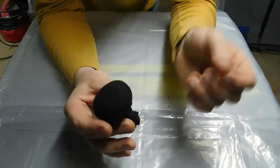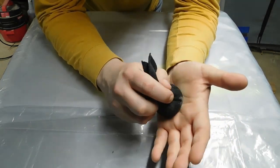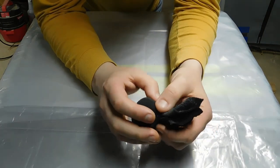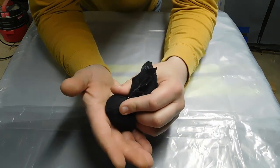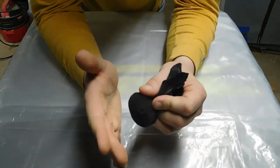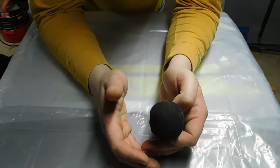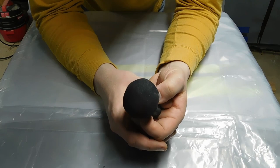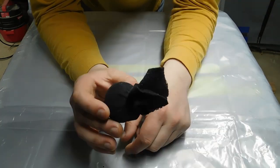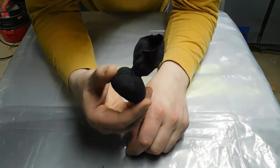I haven't had too much of a problem with shedding fibers except when using the pad on a guitar body that's already been routed. Those sharp 90-degree corners on the edges of the cavities will pull at the edge of the pad, especially if the shellac is getting dry, and it will pull out fibers. That is why I'm finishing this body before I do the final cavity routes. This is the cheap, easy way to do it — the expensive way is not any different, you're just going to use finer materials.